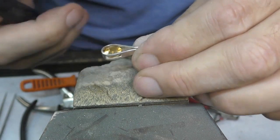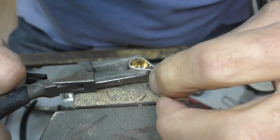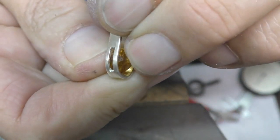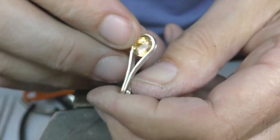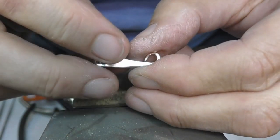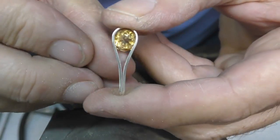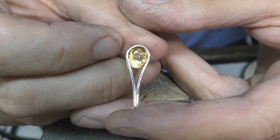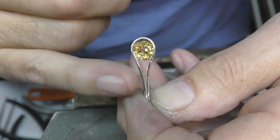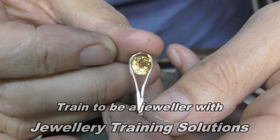It'll get to a stage where it won't come out, but you might have a little bit of movement — so if you want to get rid of that movement just carry on squeezing one side then the other, and that movement becomes absolutely minimal. You can see that it's placed in there really nicely and it's finished, but I am going to give it a polish on my polishing motor. I don't like to leave just a tumble finish — it's almost like an eggshell finish and not quite the high polish I prefer. And there we have it: the tension set technique in a loop design. There'd be a lot of possibilities for this technique — I've kept this symmetrical but you could have an offset — and I'm starting to think of other designs, even implementing this idea into a ring. Watch this space; I think I'll be doing more lessons like this.